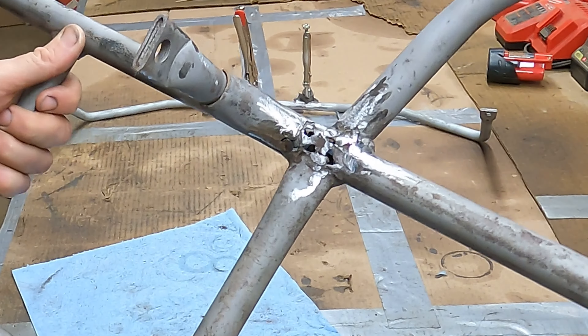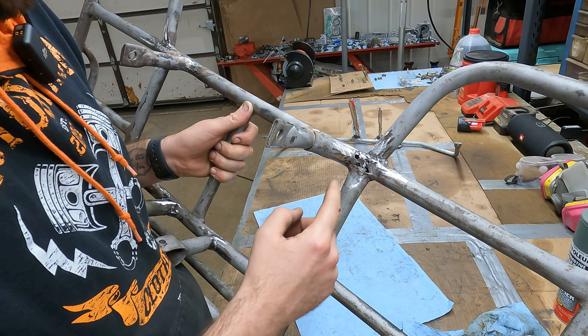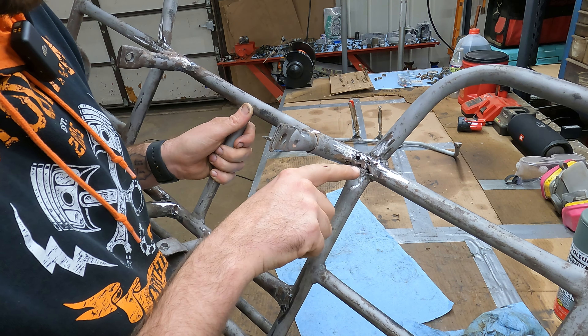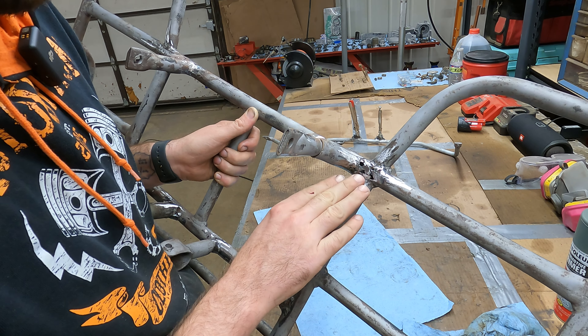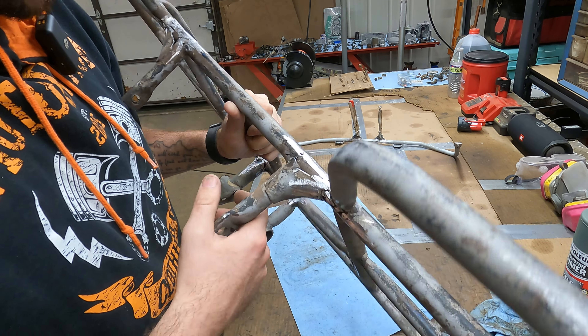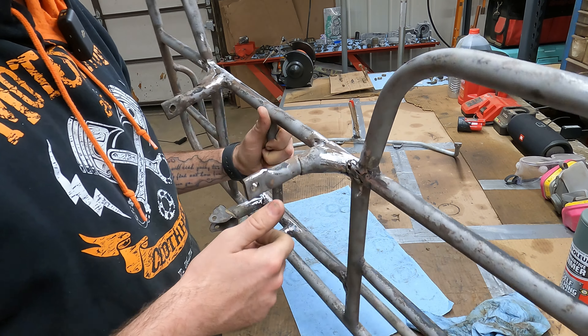With the rack, it's going to be a lot harder because I've got these holes here. We're going to try to fill the holes with weld by babying it — kind of work off the side where there's meat, put a heavy tack and wait for it to cool, then put another heavy tack, and just try to build some material back up where these holes are. Same in here — more so want to fill holes. Let's get the welder out and get on the floor so we can start welding.